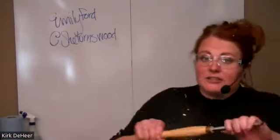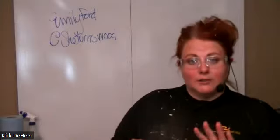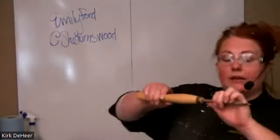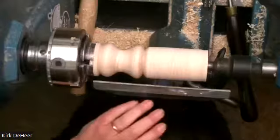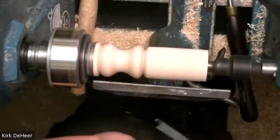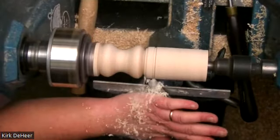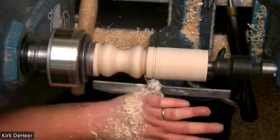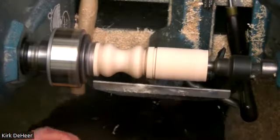It's in your whole body — not just in your elbows. You need to be able to move your whole body to apply the right even pressure while doing this. Your whole body rotates while you're turning a captive ring. So here we are — we're right at center, applying even pressure as we push forward, then starting our sway — moving to the left, then back to the right. The tool manufacturer recommends turning these at about 900 RPM — I find about 1500 works best for me.